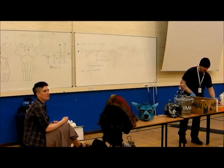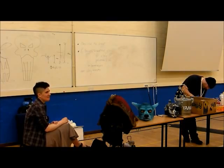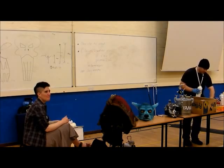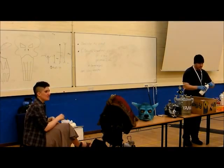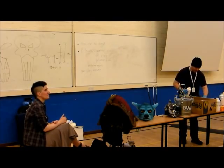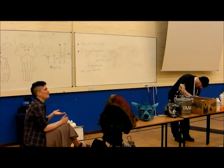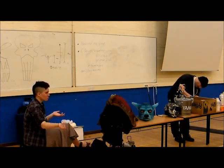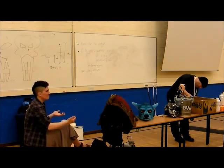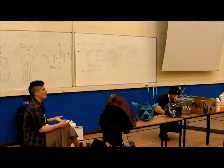Anyway, MDI, 4,4-methylenediphenyl diisocyanate, is what is known as a sensitizer. We've talked about this already. It is a skin and respiratory sensitizer. That means the first time you use it, you're probably fine, but each subsequent time you are more likely to develop an adverse reaction. At its worst, it has been known to kill, but the only recorded deaths are when people have been spraying it every day as part of their job, making trucks in factories.